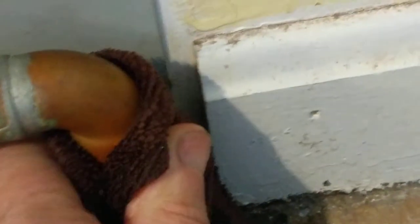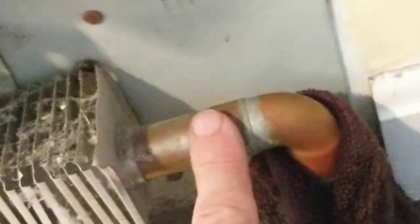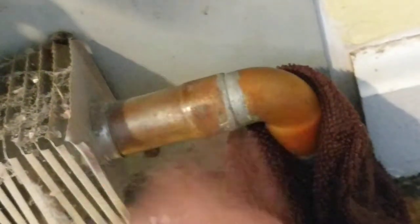I've cut through but not all the way, and I do have water weeping out which I'm collecting with a rag. I didn't know exactly how much water might come out because even though this zone is isolated and the drain is open downstairs, with no bleeder valve there could be water left in the pipe. I'm going to collect it with this rag until this zone runs dry.